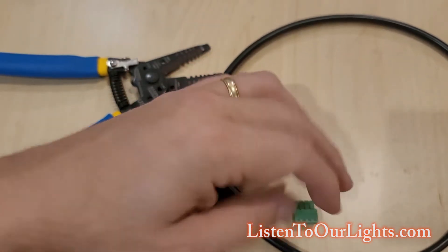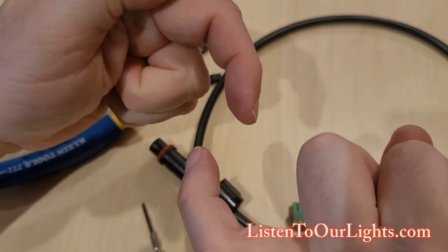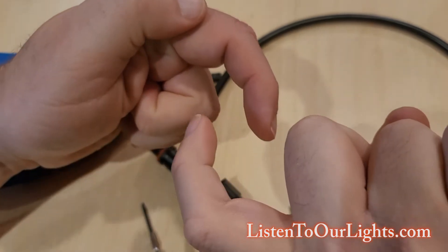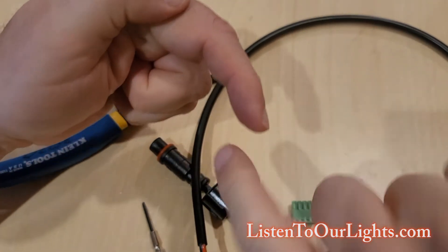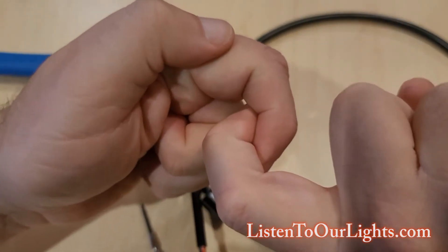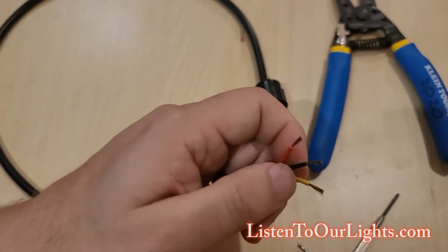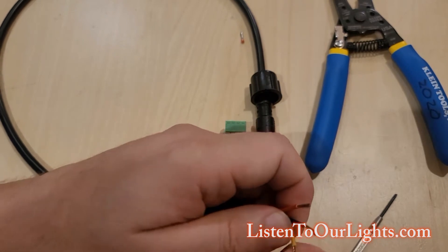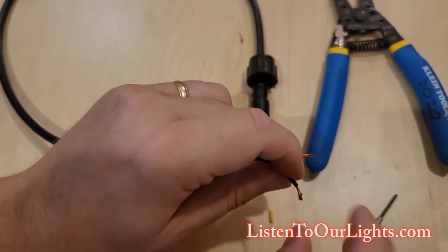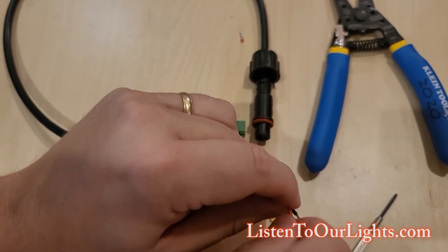What's happening on the inside is they've got a little tooth like this, and then there's a corresponding tooth like this, and when you bring them together they make a connection. So if you put a wire in between the two and then bring these together, it's going to make sure that wire goes all the way around — you get a good, solid connection. Not only that, it's really strong; it's actually really hard to pull out. You want to be really careful that the wires don't fray, so I give them a couple of spins. Because you don't want the wires to fray and have one single strand of copper going into the wrong thing — that'll cause you problems.